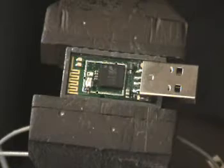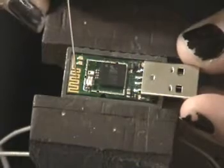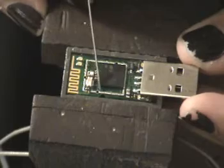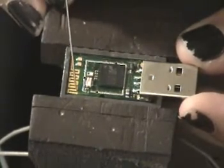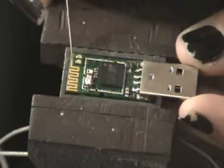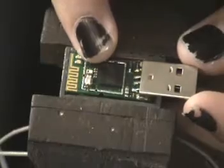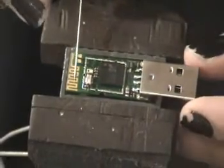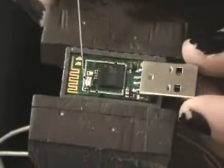Here we have the internals of a D-Link DBT120 Bluetooth USB adapter. If you notice closely, you'll see this track right here — it will lead all the way into the signal of what should be an RF box. There's no RF shielding over here, which I'll explain in a moment. This is the antenna right here. If you've noticed there's no ground plane — normally the RF shielding that would go over all of this, over here on top of all of these chips, there'd be ground. There'd be a nice big metal plate you can solder onto, like if you remember from the USB adapter segment, but this one doesn't have one.